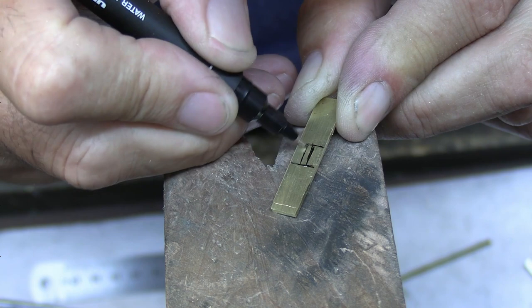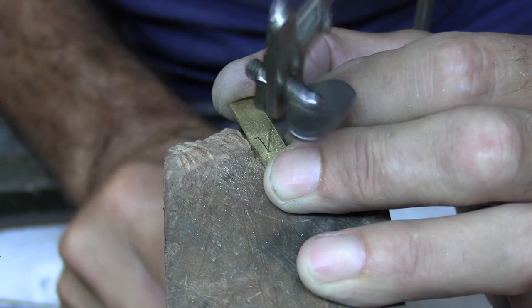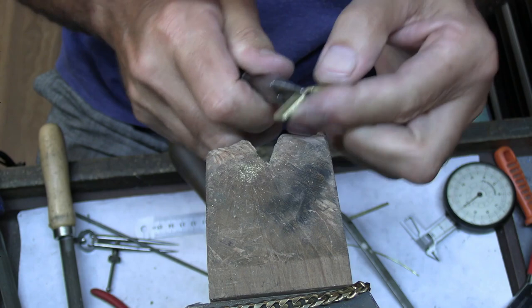Just draw in the section in the center that's going to be folded over. Coming up to the corner, keep the blade moving so you haven't got any forward pressure — you're just keeping it moving and turning it at the same time, and you should be able to get a nice sharp turn. I'll just position the pliers slightly away from the center so that I can push it around and get the bend started.